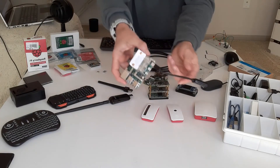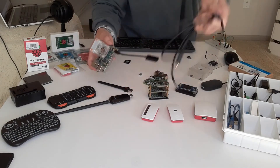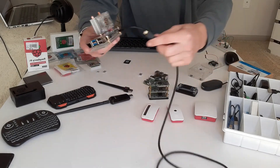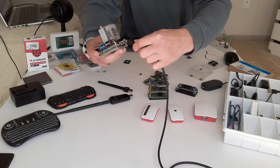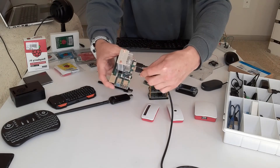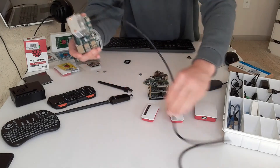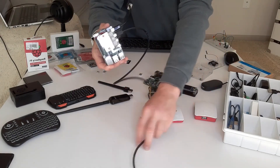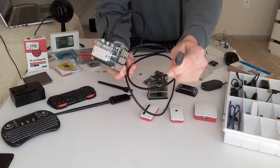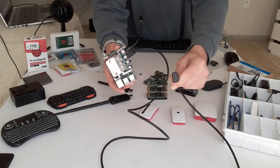With my power cable, you're going to take this end and plug it in right there to power up the Raspberry Pi. This is how we're going to be getting power to our Raspberry Pi. Then we're going to take an HDMI — one end has the micro HDMI — and plug it into that very first port right there next to the power. The other side has the full-size HDMI plug and this is going to plug into my monitor, which in my case is going to be a TV.